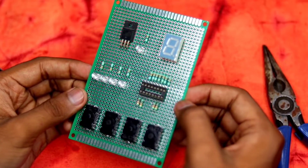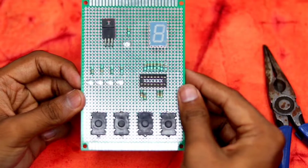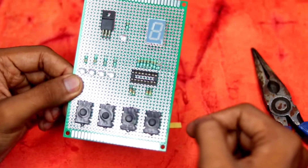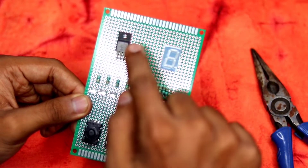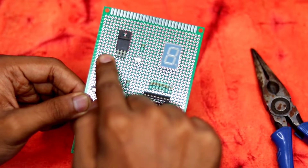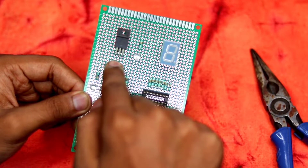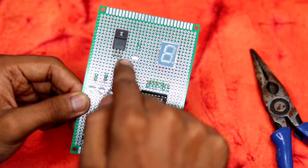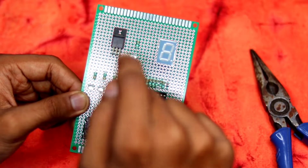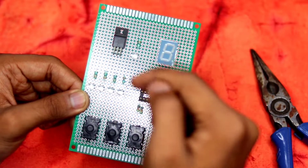After a lot of thought I've settled on this design — the symmetry isn't perfect but it looks nice. Let me explain how the circuit works roughly. The 9-volt power goes through the voltage regulator: pin one is the 9V input, pin two is ground, and pin three outputs 5 volts. That 5-volt output goes through the power LED and resistor to ground, and I'll also include a switch to turn the circuit on and off.